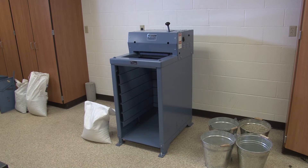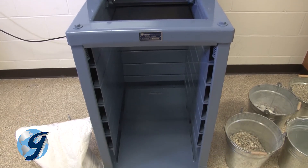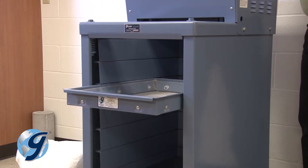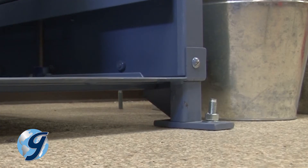Before using the testing screen, perform a quick visual inspection of the machine for damage or missing parts, and make sure there's a sufficient amount of space around all sides of the machine for operation and maintenance, and check to make sure the unit is level and tightly bolted to its rigid foundation.